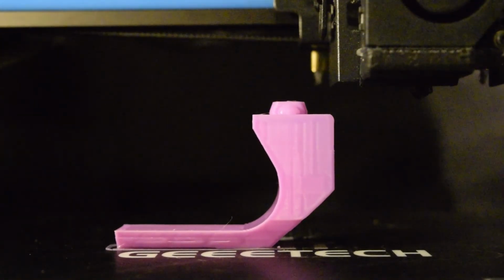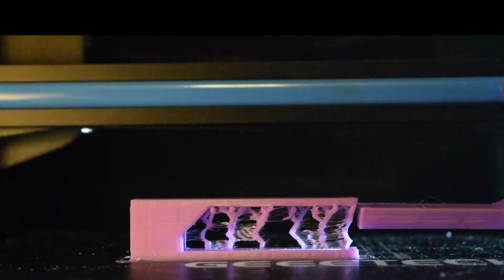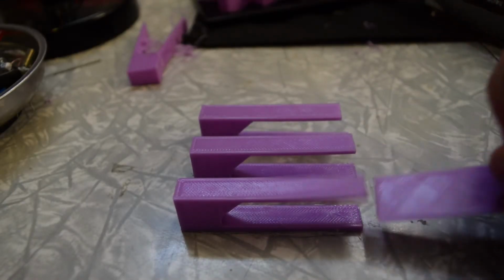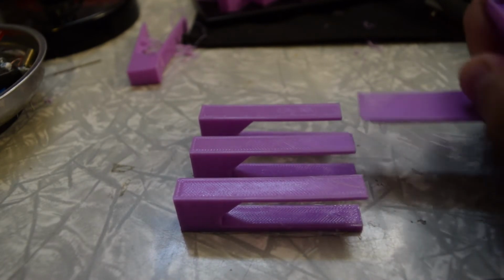All that was left to do was to bring it together with a little bit of G-code. There were 3 custom G-code scripts that needed to be designed for this project. The docking script for connecting and removing the carriage tool from the build plate, the support clearing script for breaking away custom support structures, and the performance script for playing the instrument. The third script, at this point, was going to be regarded as optional due to time considerations. Let's start with the docking script.